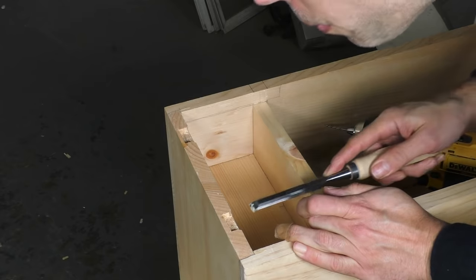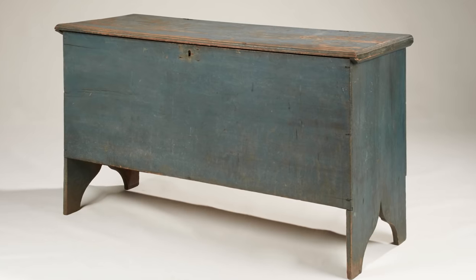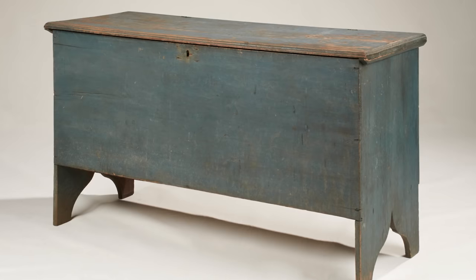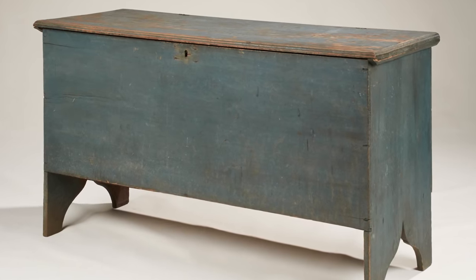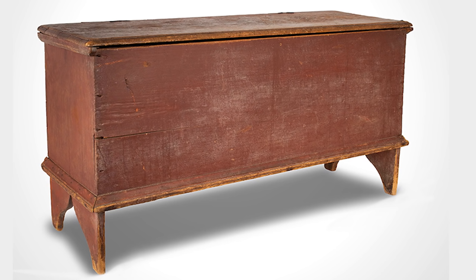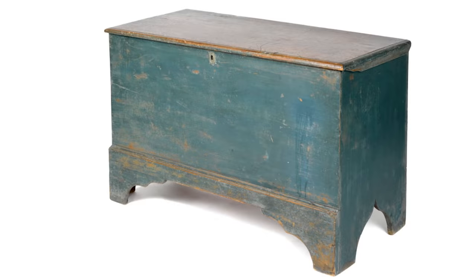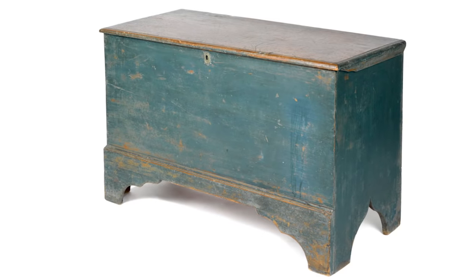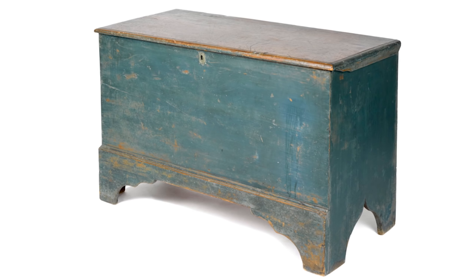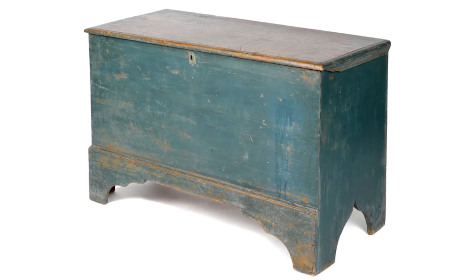Now I'm going to install the lid to the till. I'm just using cheap hinges, but they need to be mortised in pretty deeply so the lid will still close. At this point, you might just install the chest lid and call it done, but the finished chest might look a little plain — it looks sort of like it's up on stilts, with that big open space underneath. Some of the slightly fancier examples have a nice molding all around the bottom that divides up the case and the legs, but it doesn't quite get me there. Then I found one chest where the maker was a genius — they added this one piece of trim on the front that fills in the bottom, makes the legs look three-dimensional, and gives the impression of trim all around, even though the molding doesn't wrap around the ends. This is the perfect decorative touch to make our chest a piece of fine furniture.